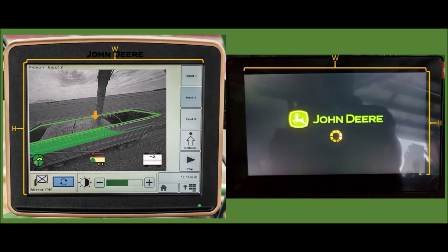The John Deere website lists a 10.4-inch screen for the Gen 4 universal display versus a 10.1-inch screen for the Gen 5. I measured a 6.1-inch height by 8.25-inch width on the Gen 4, compared to an almost 5-inch height and 8.5-inch width on the Gen 5. All Gen 5 displays have the same computing power, stated as three times faster. However, our Gen 5 booted up from both standby and cold start not much faster than the Gen 4. The faster computing does allow for additional capabilities via automation, section control, or other features. Overall, the Gen 5 is a decent upgrade, but I don't know if it would have been better to just buy a used Gen 4 and keep paying for section control.